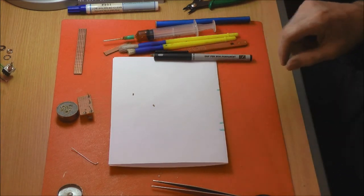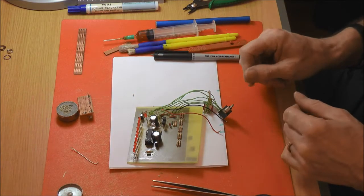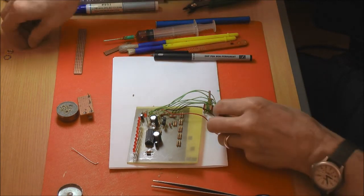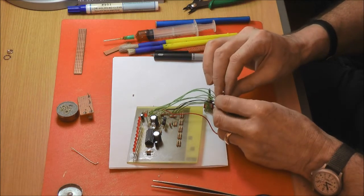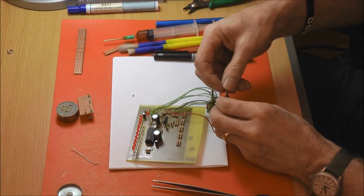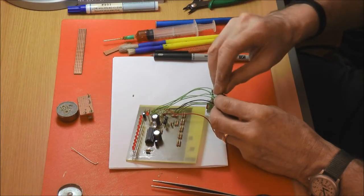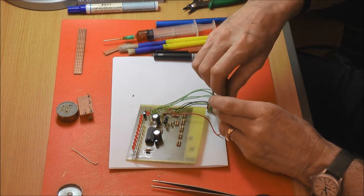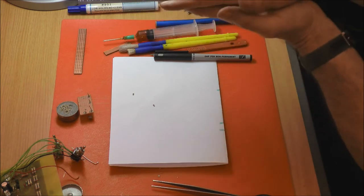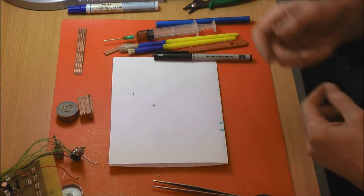I've seen people use a clothes iron as well. If you don't have a laminator, I've seen people use a clothes iron to transfer the toner. With the laminators, you've got the physical pressure of the rollers, which are quite close together, and the pouches are heat adhesive, so as it passes through the rollers, it closes the pouch and adheres to whatever's inside it.